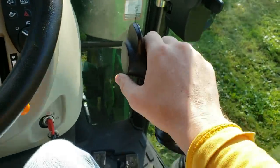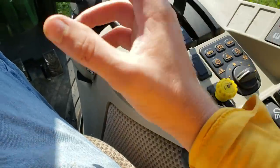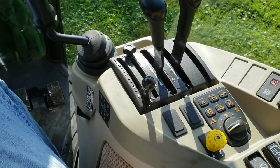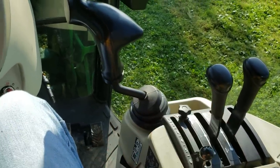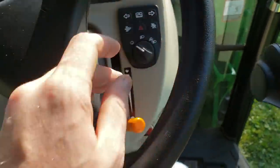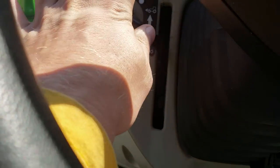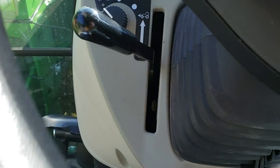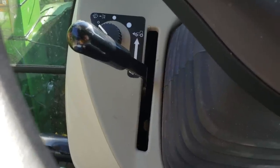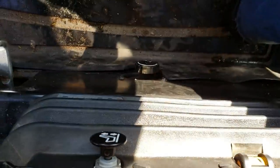I wish the joystick was positioned a bit further back so you could rest your arm on the armrest. On some five-series tractors you can get it as part of the armrest — maybe they can come up with a cost-effective solution for those of us who do a lot of loader work. Lights work great, throttle works great. The four-wheel drive engagement: putting it in is easy, but taking it out has something going on where it catches and is kind of hard to disengage. I've always managed to work through it, but just something to be aware of. The air seat is phenomenal — probably one of the best in the industry.